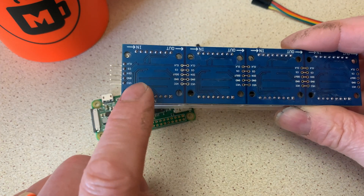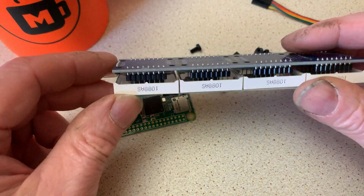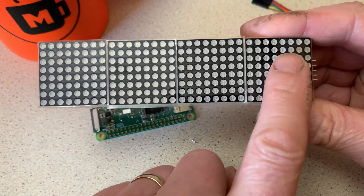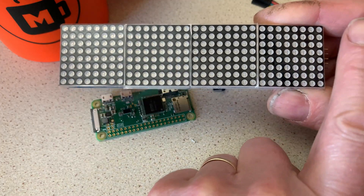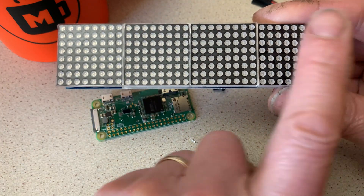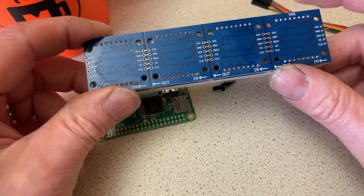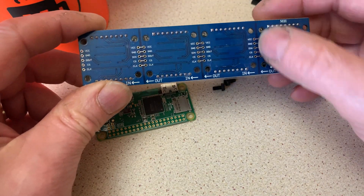With this serial interface you could snap these off if you want. All four displays are linked together and you feed the data in serially — one end feeds to the next display, and the next, and the next. You'll basically see a scrolling display of information going from right to left. There's nothing to stop you splitting these if you want — if you buy the four-up module you could end up with two or four single modules depending on how you break them.